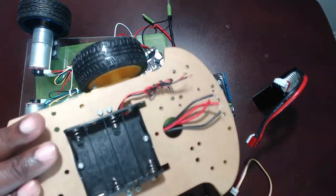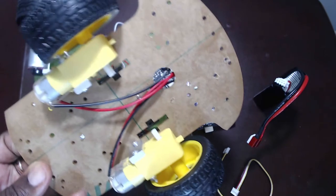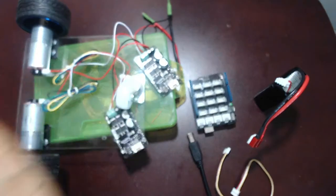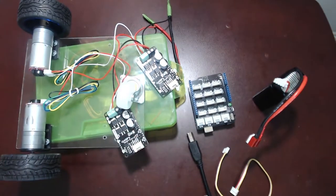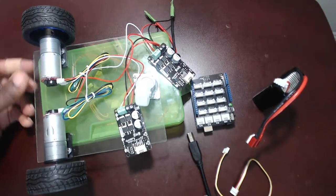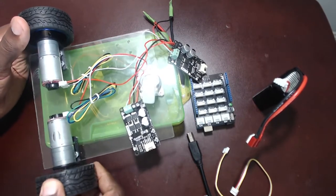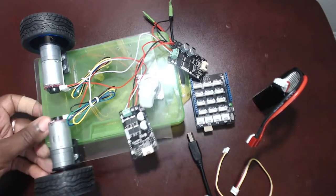I cannibalized my little robot car platform that had similar small motors. If that's not going to work in testing, I don't want to waste time. So I took out the caster wheel from the front, got some plexiglass, and cut it into a square. It's not as fancy but it works. In hindsight I maybe should have used thicker plexiglass and spaced the motors a little closer.